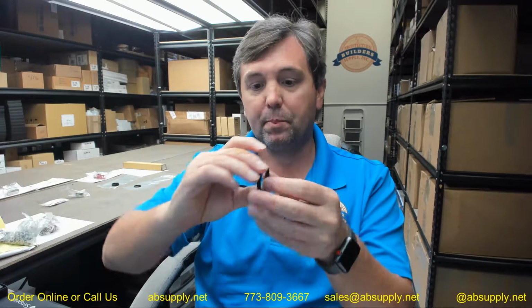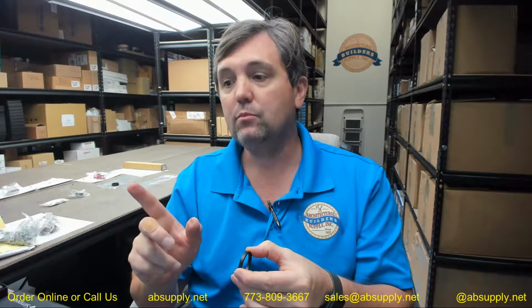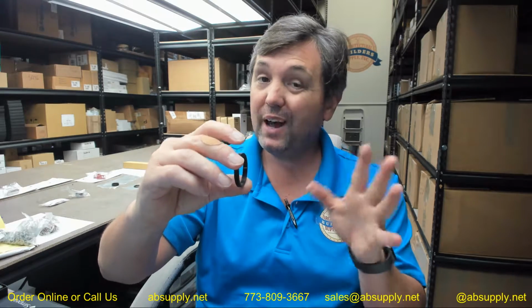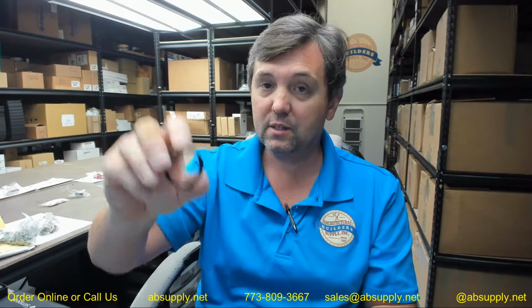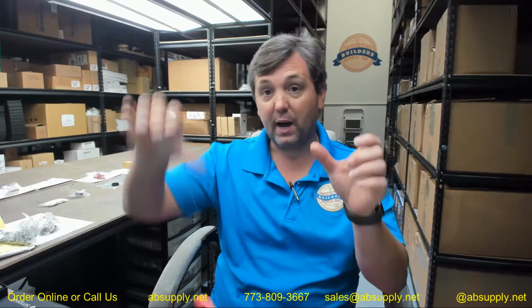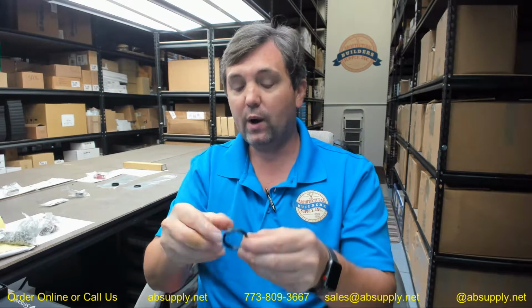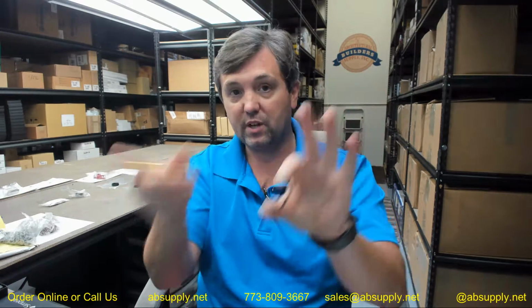So a good installation of this is going to be where the ring, after you've installed the cylinder, if it's a mortise cylinder or a rim cylinder as well, you will want this to be snug on the door, but you'd actually like it to turn a little bit. Not so that it rattles, of course, but a good installation would be is if I were to try to attack the head of the cylinder with a pipe wrench and spin it off to be able to remove that cylinder and stick my finger in there and work the lock. You want them to grab that cylinder head first and rotate that.